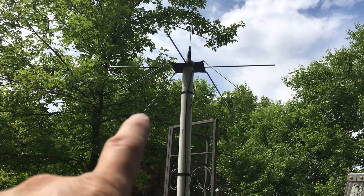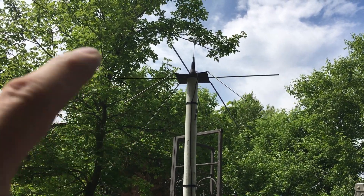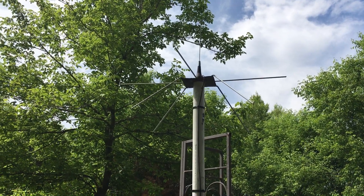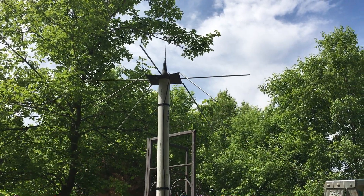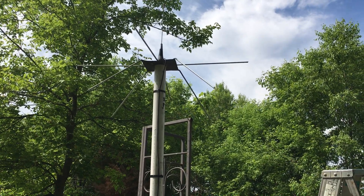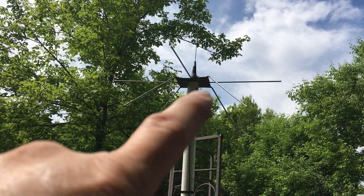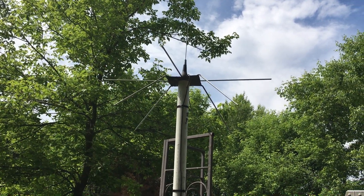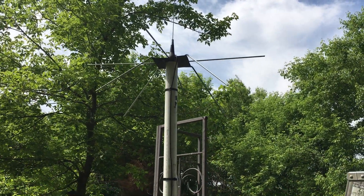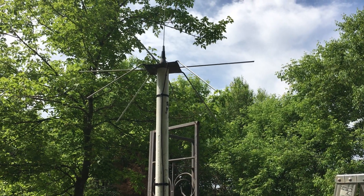I did four ground plane aerials at a 45-degree angle — I did a video about that a while back and I'll try to post a link below. That's because you want to get the impedance to about 50 ohms; 45 degrees is a rough estimate and you'd probably have to tweak it a little. I also did four aerials straight out for the ground plane, because it's a magnetic mount and on a car you usually don't have 45-degree angles.